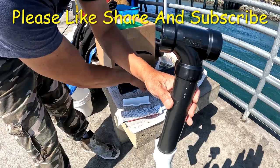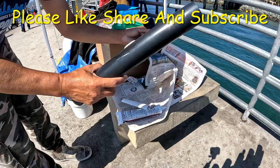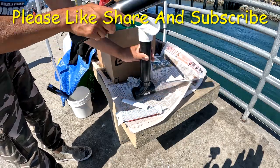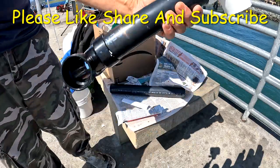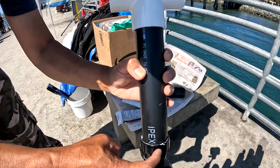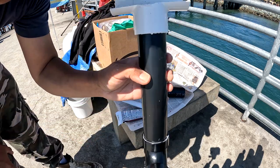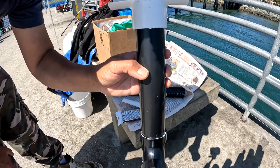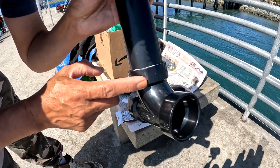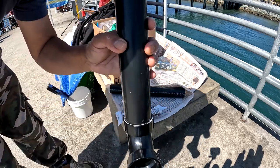Now it's straight, we can tap it. Don't break it — make sure you put a screw here, screw right here, right here, and right here. Put about four screws to make it stronger, because the glue still comes off right here since this is too shallow. This right here is deeper, so make sure you have screws.